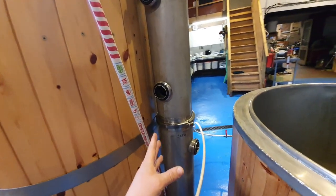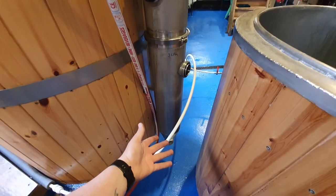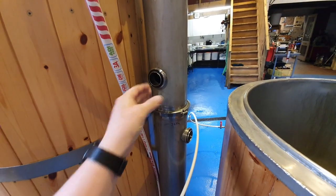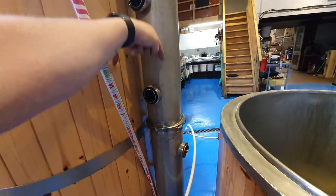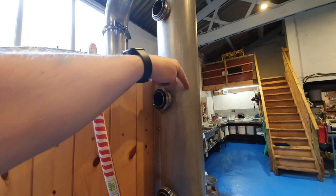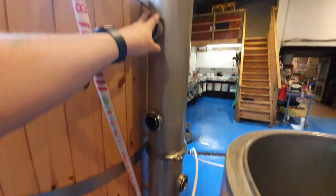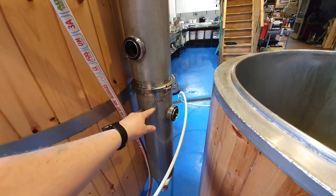Now, the reason I rotated it was we were getting steam out the bottom off the first trial of this. So what was happening was, as the cones were coming out in an upside down kind of triangle shape, all this section here by the jets themselves didn't actually have any spray. So the steam was channeling down the sides and completely missing any of the jets. So by simply rotating this last one, we kind of blocked that off.